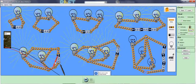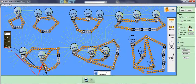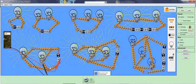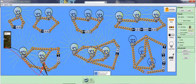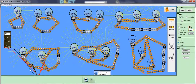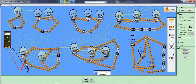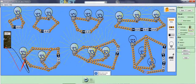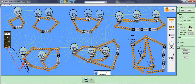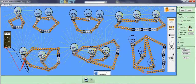Now the interesting thing is when I read across the bulbs here, I end up with something very strange. Wait a minute. Let's see what I did with my connector here. There we go. 8.999 volts. Again, that's 9 volts. And then across here, I may have my electrodes too close, 8.9998 volts.